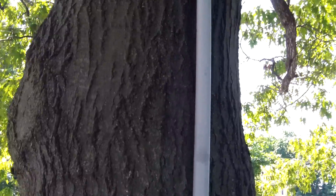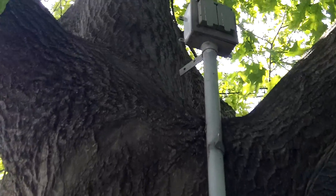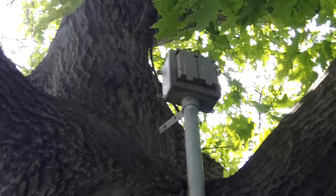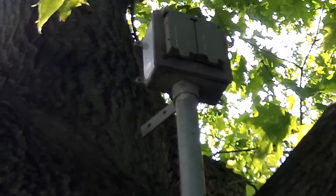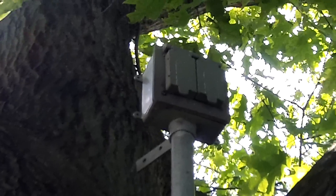As we follow this up, we'll see another clip has come off, and the box is not supported to anything. Also, I'm assuming those are receptacles in that enclosure, so we've got several violations.